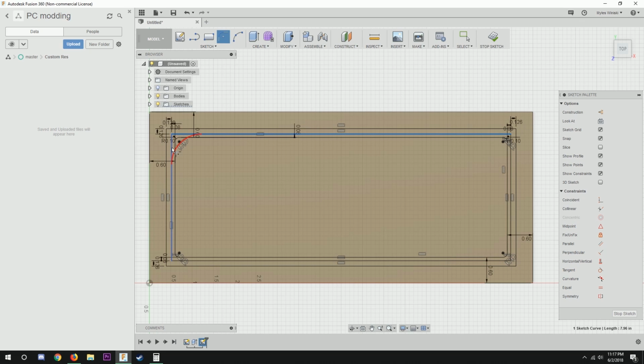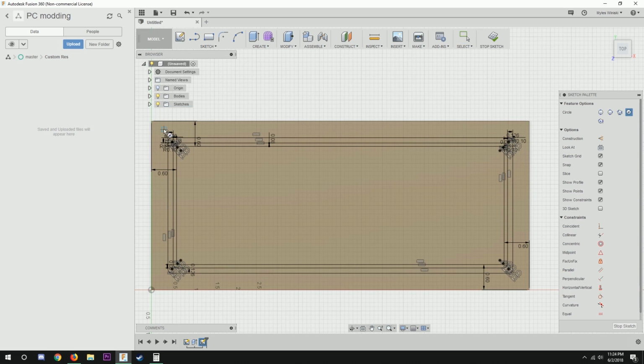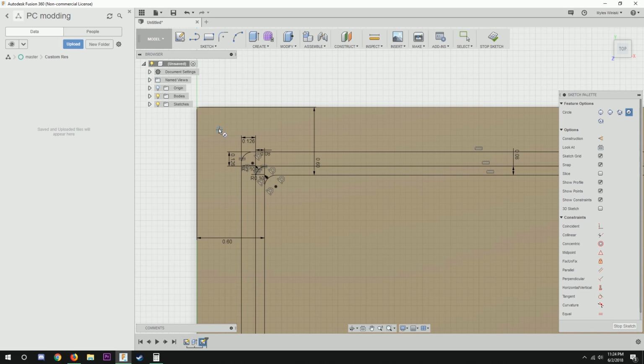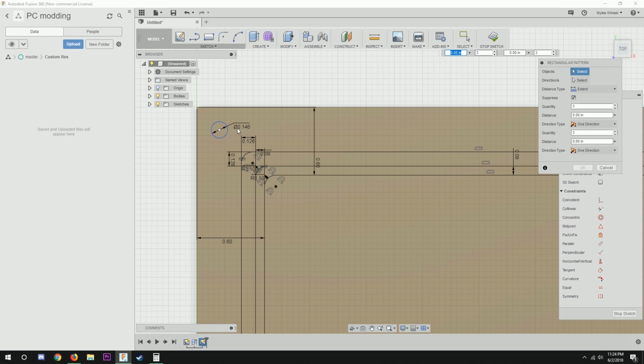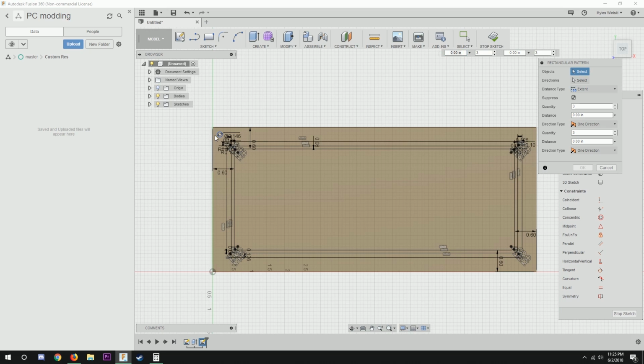So once you've told the program where you want to cut out and what tool you're using to cut it out with, then it generates something called G-code, and then you load G-code up into whatever program you're going to use to control your actual CNC machine, and G-code is just the instructions that your machine follows, because it can't read a picture. So the picture is translated into a code that your machine can read and then act upon.